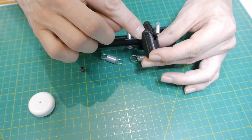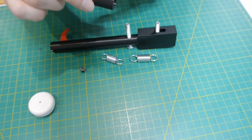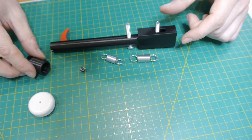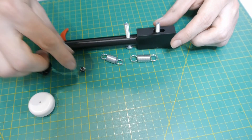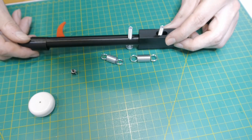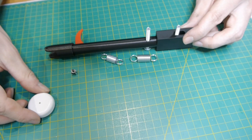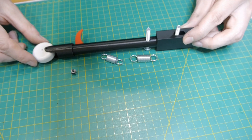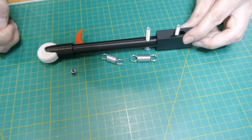Because the legs of the buttons are at the other side, cables have to be soldered to them. These cables will be routed through a hole in this cap and back through the whole shaft to the Arduino. So the tactile switch sits in the cap, and the cap goes on the end of the handle, fixed with two set screws. At the end, the hole will be closed with this wheel here, fixed with a two-millimeter brass rod.